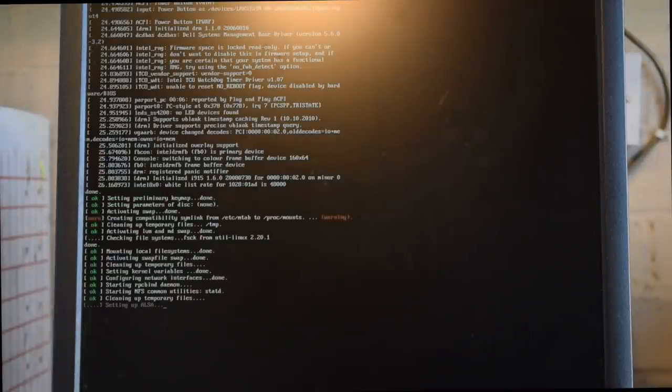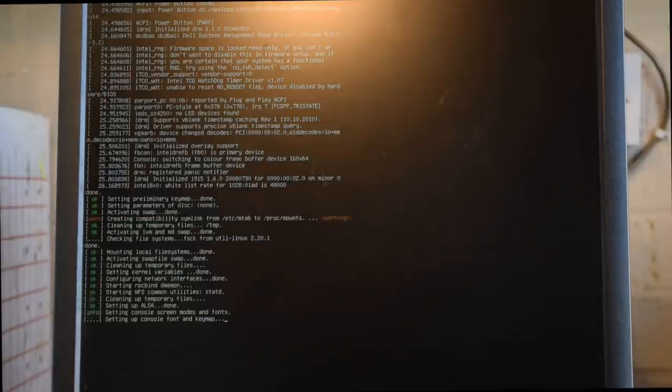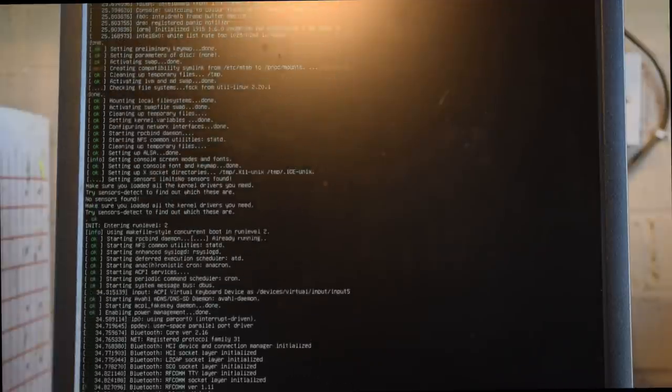So in CNC terms, what that really means is that the machine isn't going to be interrupted while it's on some critical instruction, which, if you're running a CNC job, could mean that if it is interrupted, it could be in the middle of a tool path and cause an error and cause you to ruin the job. So what we need to do is do this latency test first, get the figure from it, and then see what happens.